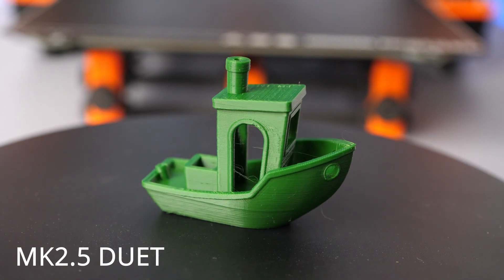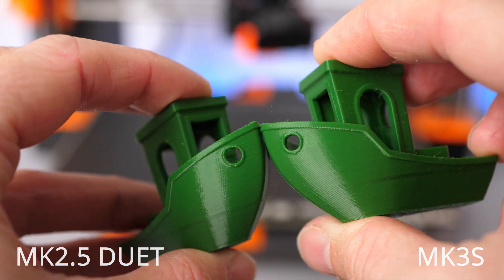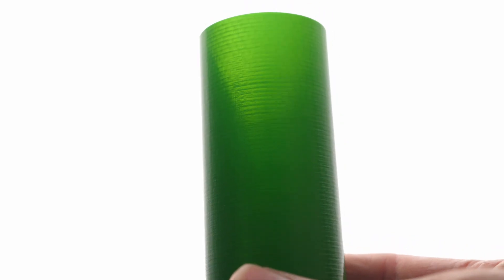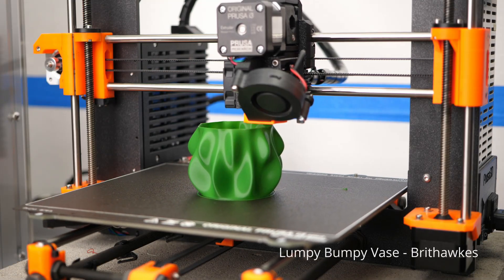The first parts were promising, but on closer inspection I was able to see layering inconsistencies and first thought about backlash in the old z-axis lead screw. After printing a simple cylinder it was even more obvious because there a regular z-banding was clearly visible. On any other printer I would have said that this is the result of a wobbly z-axis, but since I know the printing performance of this MK2 after probably 10,000 hours of printing very well, it was clear to me that this could not be the case. After more thinking it finally dawned on me.